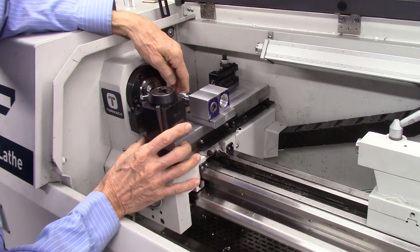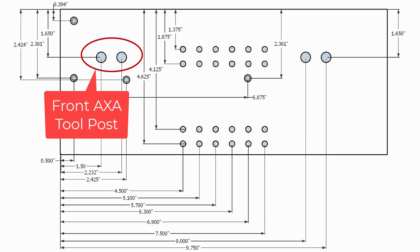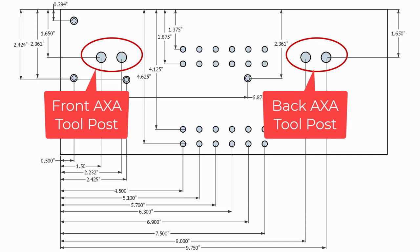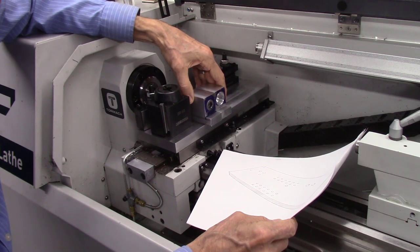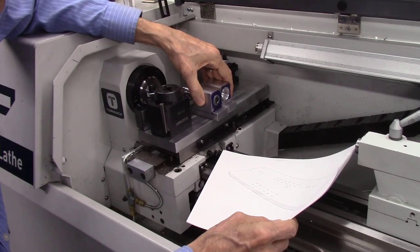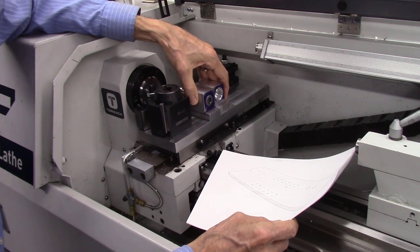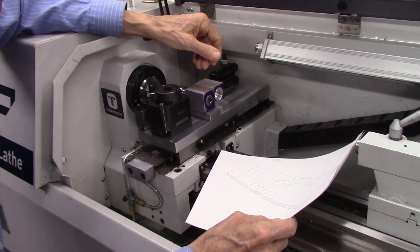My first step is to make a plate. I did redesign this — this is the design I came up with, and I drew this in SketchUp. I'm drilling multiple holes to make the system quite versatile. The front tool post will have two positions you can mount it in, and likewise the back tool post will have two positions for more flexibility. The gang tools in the center can be stepped over in half-inch increments to give more variation in what you want to do, with multiple steps front and back to make it quite versatile and easy to use and change tooling.